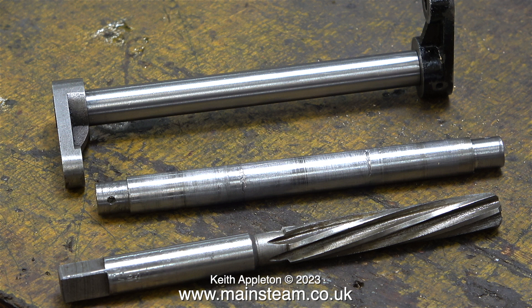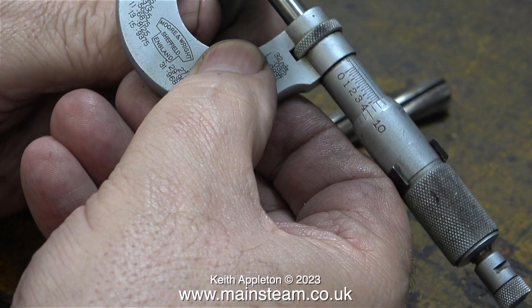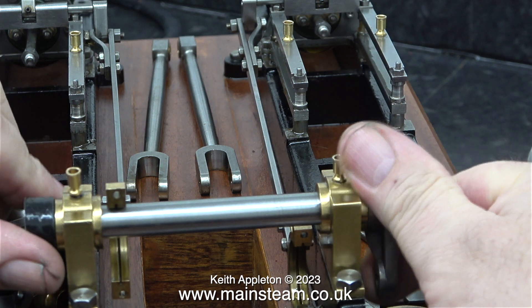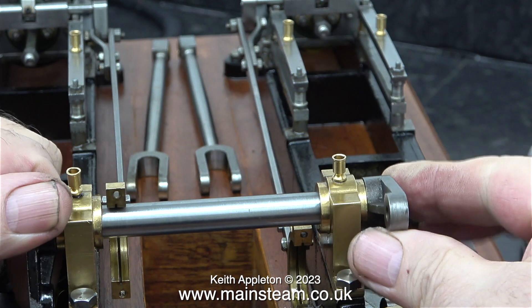Because these are tutorial videos I use tooling that is commonly found in home workshops. The collet system that I use is extremely accurate, which is more than can be said for a lot of budget collet systems — I bought a set a while back which was so bad I threw it in the bin. This is the only time in the video I'm showing my micrometer, and I'm just using it to compare it with the piece of silver steel that I bought, which is accurately ground to seven sixteenths of an inch diameter. To be honest it's very close but not close enough. With the new crankshaft fitting into the main bearings with both crank webs in place, it's a perfect fit.